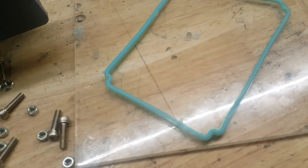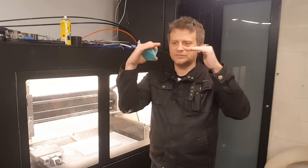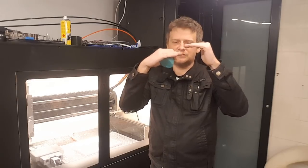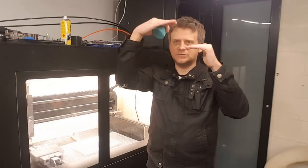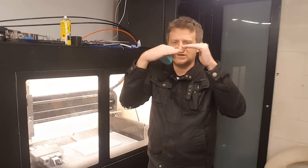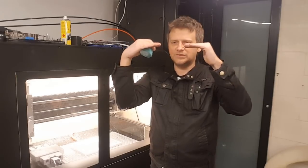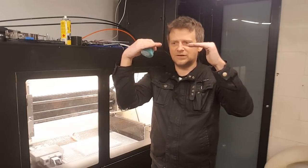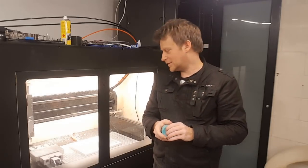Awesome. I like it. With the gasket like this, when you have a channel in the vacuum plate, you have a base material lower and then that bit sticking out higher, so when you put something on, you're compressing it in, so you're not pinching anywhere, and when you put the material on, it rests on the vacuum plate, not on the gasket, or it's pinching the gasket or anything like that. So that was the reason behind it.